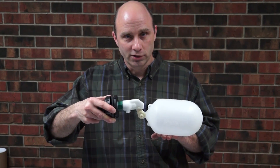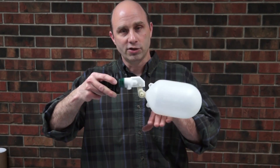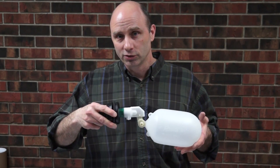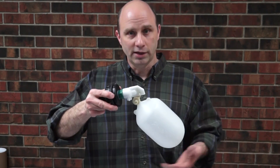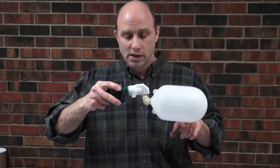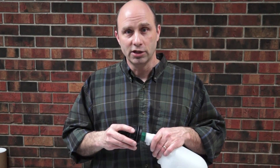When you're in a dripping situation, it might take a while to get enough water level change to add that much pressure on the float. I have seen conditions where you could get dripping 15 to 20 minutes after you think the valve should really have stopped. It will eventually stop. So we just want to make sure your issue might just be normal operation of the valve, not an overflowing condition.